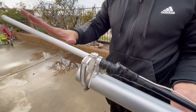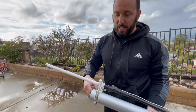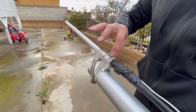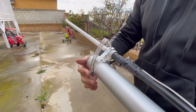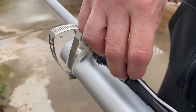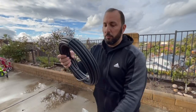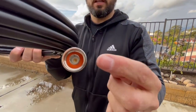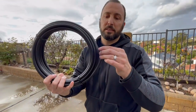Look how small this antenna is right here. This is the one I got from eBay, and it didn't really even have a bracket like the one I bought now does. It kind of has a little flimsy one, and we had it on here by plastic zip ties and then this metal reinforced zip tie. I do have the lightning arrester right here. So this is the new LMR-400 — this is the N-type male, and it does have the little screw right there. If you look all the way in the middle, it's pointy and it's not hollowed out, so that means it is the male.